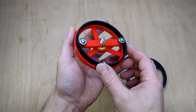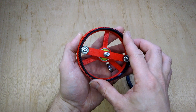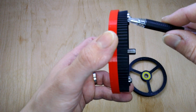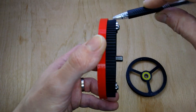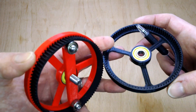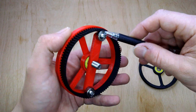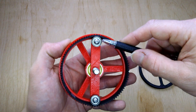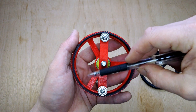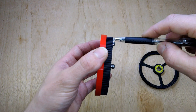I was trying to emulate the splined cup with this part, which meant that the belt was fixed inside it. And when you look at the deformation up here, you can see that only part of the belt is going to come into contact with the inner ring teeth. Not only that, I don't know how well these timing belts do when you bend them this way across here — they do fine going around the other way, but I don't know what happens when you do it that way. So I thought that's something I could try and improve on quite quickly.